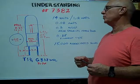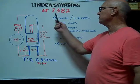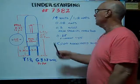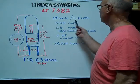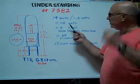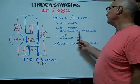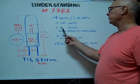Hi, here at BulbTown, we want to help you understand and identify the number 7382 miniature bipin bulb. It's rated at 14 volts, 1.12 watts. The amps are rated at 0.08. The mean spherical candle power is 0.3.